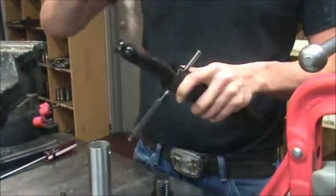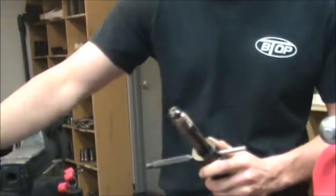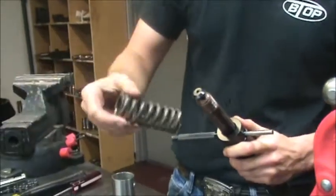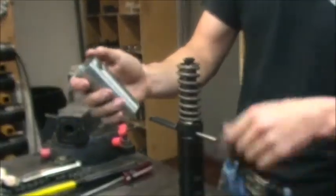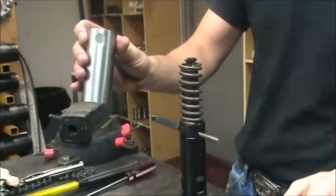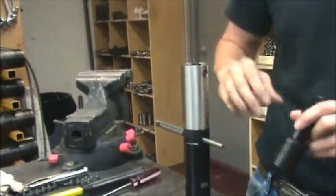Take your little grease, grease up your core, grease up your thread, take your core spring, take your shear pin cover, no hole up, so when you put your top sub, you can put your set screw. Alright, now I'm going to go on over to the press.